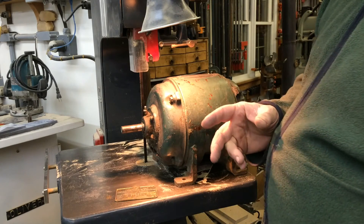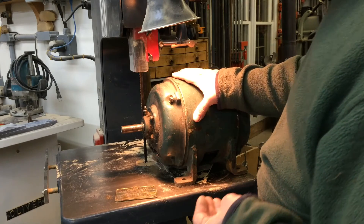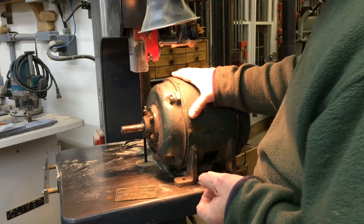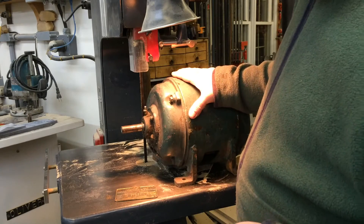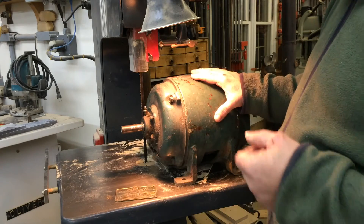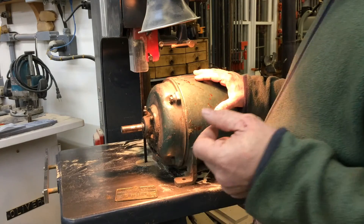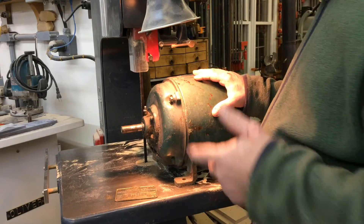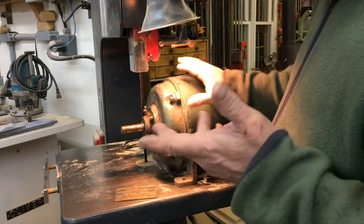The planer has a three-speed transmission. Currently it's set up for 20 feet a minute, 30 feet a minute, and 46 feet a minute. What I'll do is install this with the same pulley. Because I'm dropping a third in speed, my 20 feet a minute will become 15, my 30 will become 20, and my 46 will become 30 feet a minute. What's even better is the machine has run on 20 feet a minute pretty much since it was built in the 40s, so that gearing is worn a little bit. It'll be good to actually put it into the 30 feet a minute gear, which is in pristine condition, and run that on a regular basis.